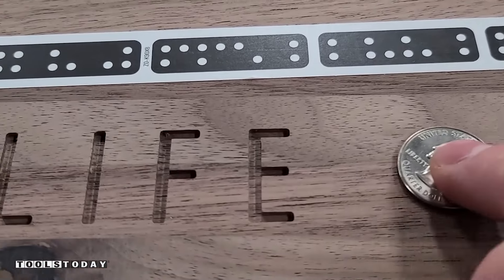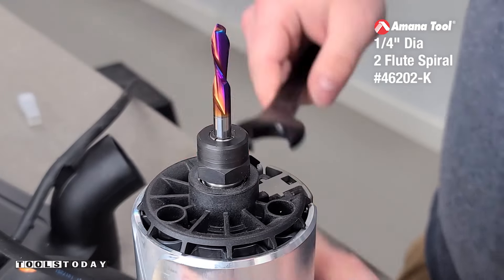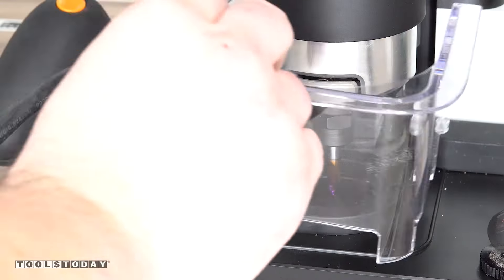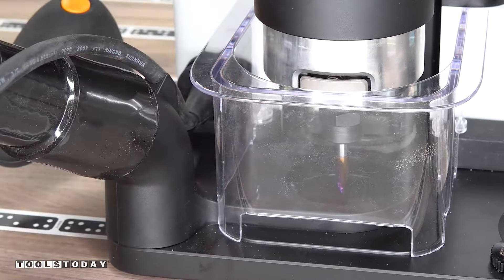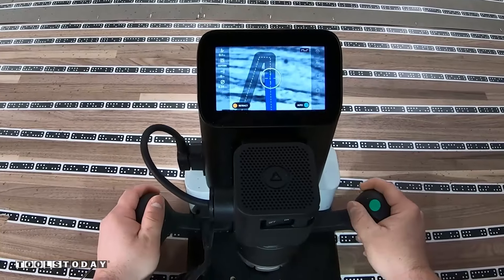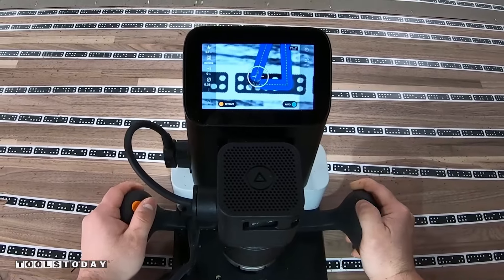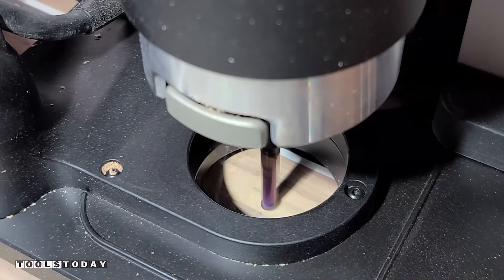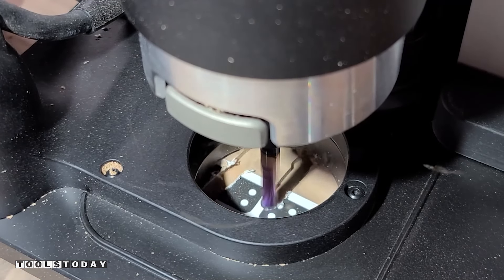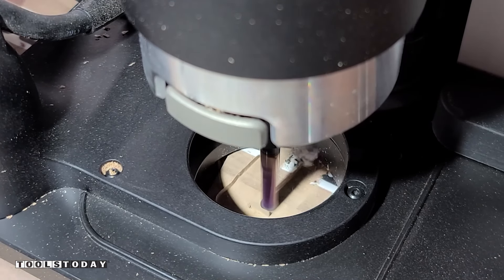After the 1/16th inch bit was done, we switched out for a quarter inch bit — the 46202-K quarter inch down-cut bit — and got that installed into the Shaper. We'll touch off; it just touches off the material and as soon as it feels any resistance it pops back up. We get the dust collection all installed and get to cutting. This is how you do a pocket with the Shaper: we'll do an outside profile cut on the inside of a letter, then we'll do a pocket cut, and the pocket will essentially let us cut within that area and remove all of the waste material. When you're doing a pocket cut, it will correct your movements up to the edge but within the area you just remove it as you see fit.